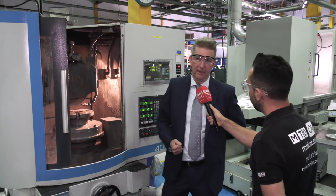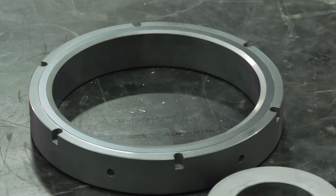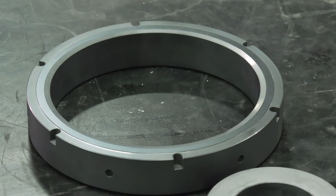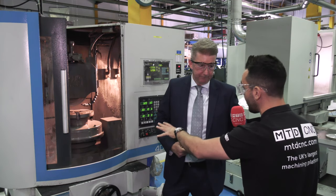On this application, they're looking at around 10 microns — less than 10 microns. That was what they wanted and that's what they've got. So with this application, it's not standard. Obviously, you used a standard chuck, but it's a bespoke setup.